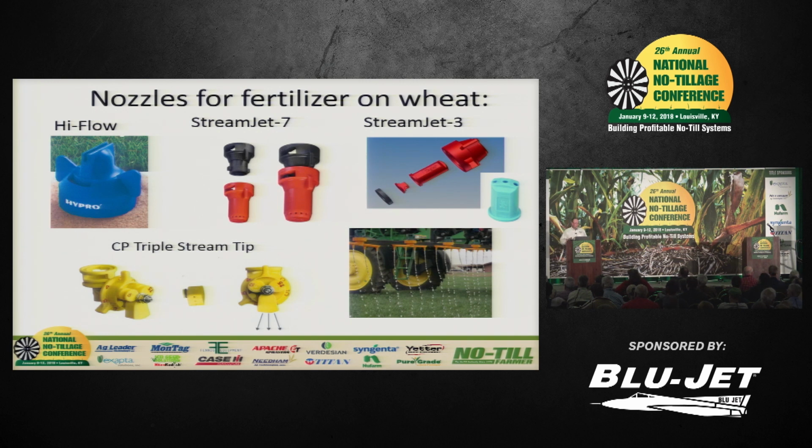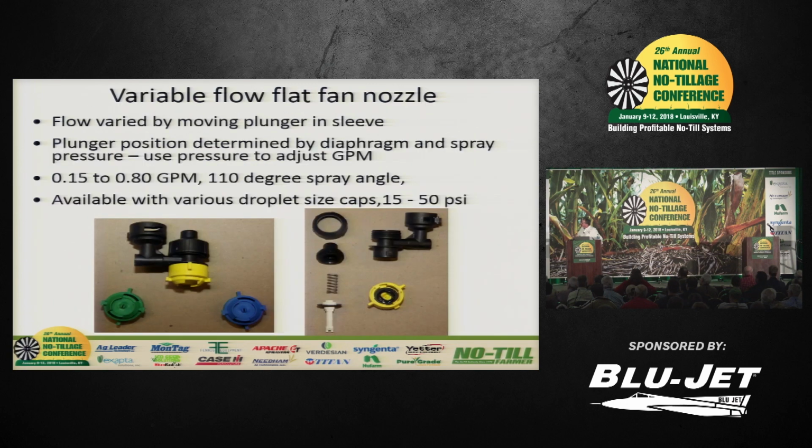Okay, next picture, nozzles for fertilizer on wheat. I thought it'd be a good scenario here to bring up. And we don't necessarily atomize our fertilizer, so there are nozzles designed for the purpose of streaming it, putting it on in a different fashion. And then there also is a nozzle out there that's not been that popular in the agriculture market, and that's the Vari-Rate nozzle that has a spring and a diaphragm that can be flexible on rate.